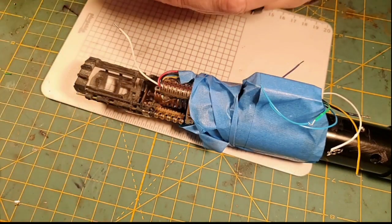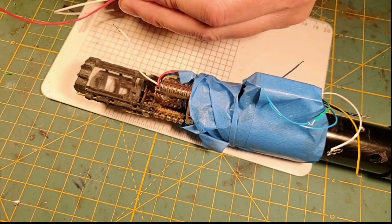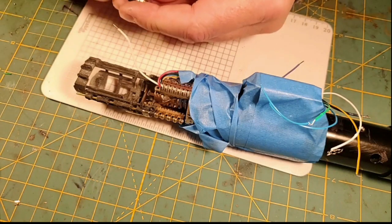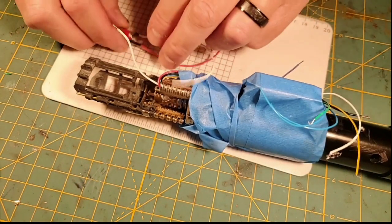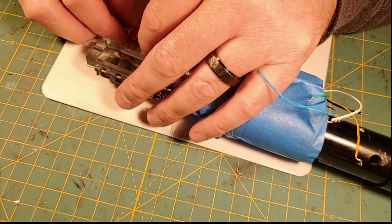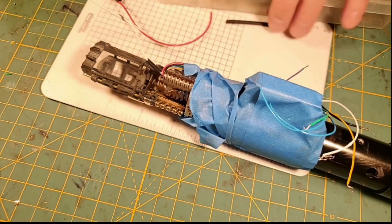That wire's tinned. Now I'm going to go ahead and cut off a little bit of this leg of the negative on the recharge port, just a little bit, leaving enough to solder to. And this may be interesting and fun, and I'm going to have to put my shrinkaroo on here first. I'm going to put it on the battery negative wire.